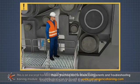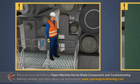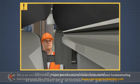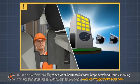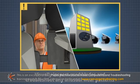Visually inspect loading mechanisms and oscillators and repair those that are not functioning properly. And visually inspect used blades and troubleshoot any unusual wear patterns. Doctor and blade manufacturers can help identify the causes and cures associated with many unusual blade wear patterns.